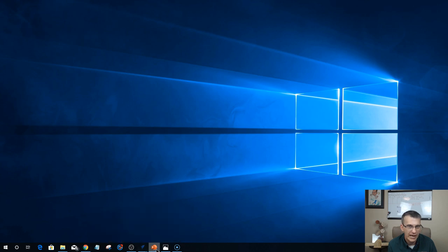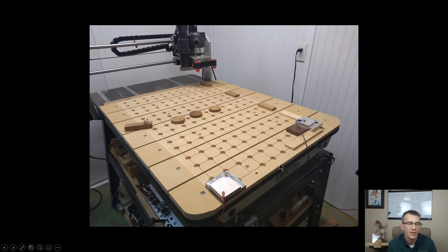to you how we would go about making this table. For those of you that don't have the 2440, you're going to have all the holes laid out, all the lines, but you're going to have to change the size of the material. You're going to have to change your placement and everything, and lay it out for your table. Your boards might not run vertically or horizontally across the table because your T-tracks run horizontally across the table. If they do, then your slats are going to run lengthwise. Our T-tracks run lengthwise, so our waste boards would run across the width and everything.